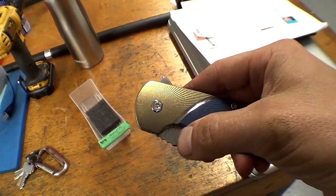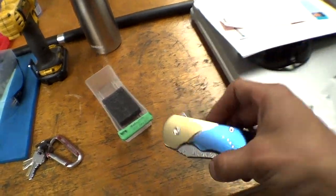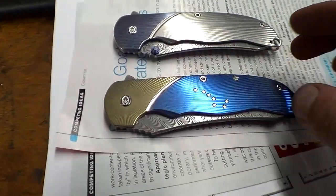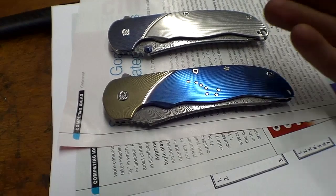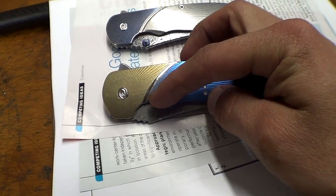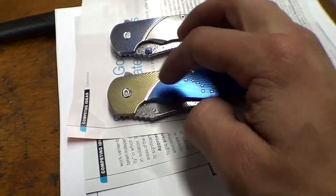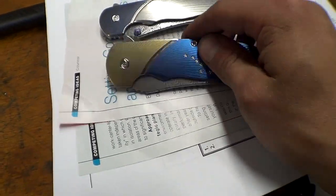Eric mentioned in a very complaining way that this arc is the bane of his existence. So, like, for my knife, also has the same arc. Every time he does it and has to do a two-color anodizing, it's difficult. And sorry I didn't get to film. I didn't have him film when he was doing it. But basically he used, you know, various combinations of nail polish and electrical tape to mask off one whole section while he anodizes the front, and then has to manually polish the inside without affecting either of the anodized colors. And it's difficult, and it's very easy to screw it up. And he did screw it up the first time.